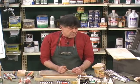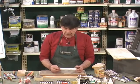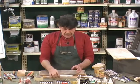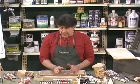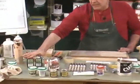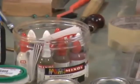Now, both of these, in this case, most of them come in a universal color. And you'll see some of them will say natural, and some of them will say red, or medium dark, or whatever the case. To have a couple of them where you can intermix is a real good idea. You can actually take the trans tints, which is a dye, and it's used exactly for what it implies. That's for tinting it. And the Mixol. Mixol is a pigment. You can mix it in there to get your color.